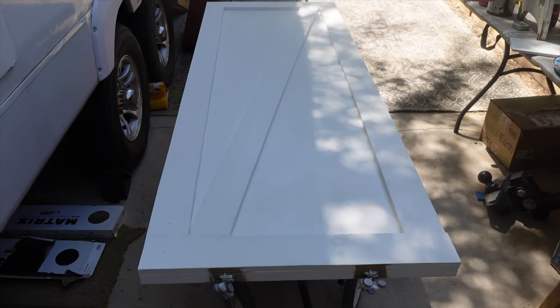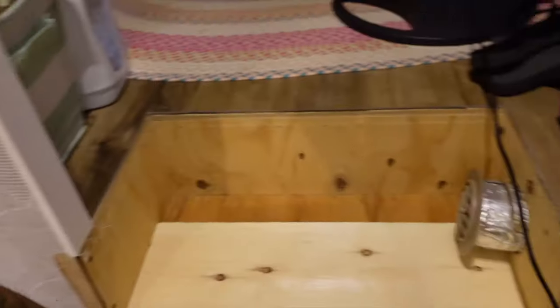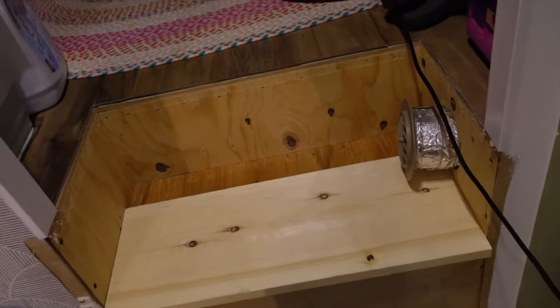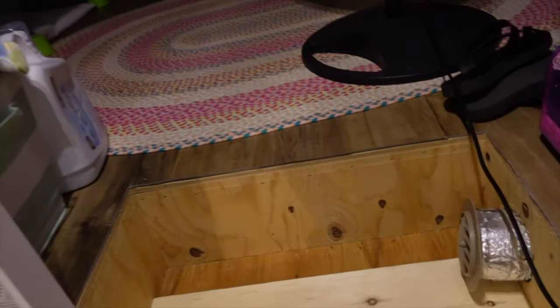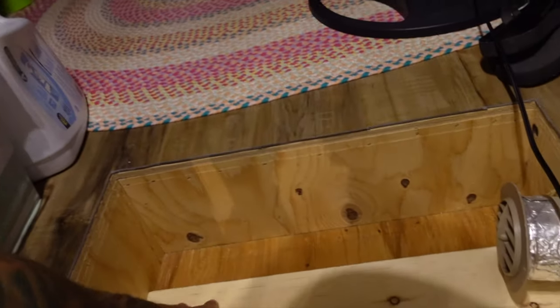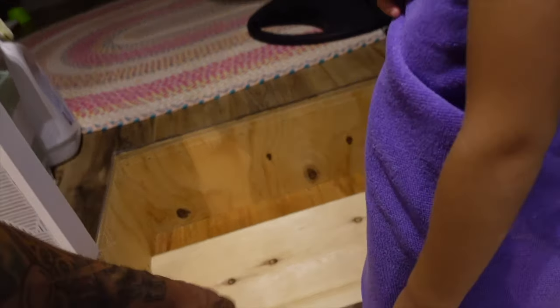Rustic. Kind of original. I thought it would be good to have an original door in there, so that's why I did the one stripe type of thing. Today we went to Lowe's, got some board, and this piece is a little bit wider than I got. The rest of the steps are 9 inches — this is a 10-inch piece, so this is going to work fine for the rest of the steps. But I didn't realize at Lowe's that this first step is a lot wider, so I'm going to get another piece of board and just cut a strip, tie them in together. We're going to stain this, and we're going to have our tiles on the inside — on the face of it, the tile, and some stained pine whiteboard.